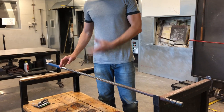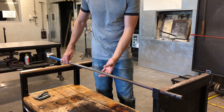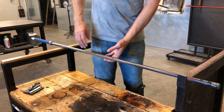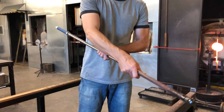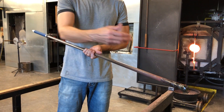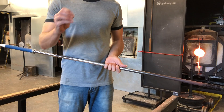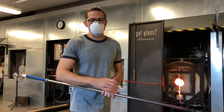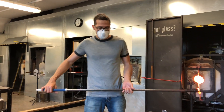The way you know where it's hot is by sliding your hand up. The way people mostly get burned is by grabbing a blowpipe where it's hot because they think it's cold. So what we have to do is trick ourselves into never grabbing the pipe, only sliding our hand.